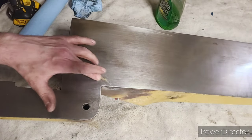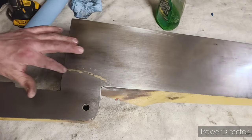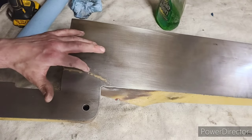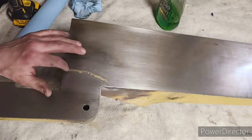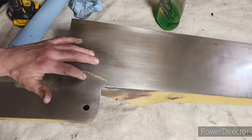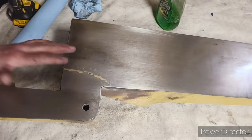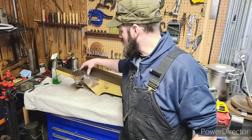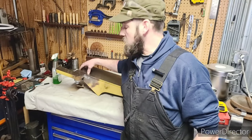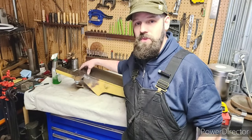Here is the final product. As you can see, there are no more cracks — all the low spots are filled in. A few spots here the brass just didn't really bond to it, but I didn't want to take this down any further. When I move my hand across here, I can barely feel anything at all. This is definitely going to hold — I'm happy with how this turned out. More often than not, you need typically two tries at brazing something, but if you're lucky and careful, you can get it done in one. Well, there you go folks — a quick crash course in how to braze. This turned out very nice, I think my client's going to be very happy, and this is definitely going to withstand the test of time. Thank you for watching — please like and subscribe, and stay humble.